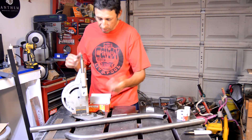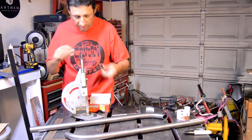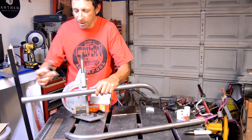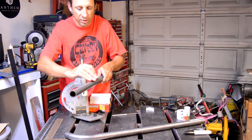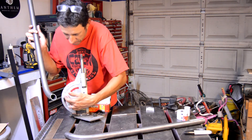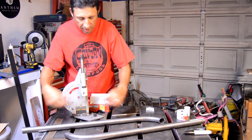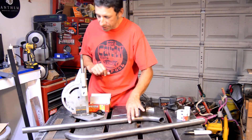I'm going to cut it with my hole saw and have some little mounts. I've got some brackets here for 31.8 — from a broken set of aero bars — so I'm going to take some aluminum stock, drill and tap it, bolt those on, and then it should be able to just go off the existing setup. Put three or four bolts to secure it in place, get it figured up and mocked up. Should work out really nice to drill those.